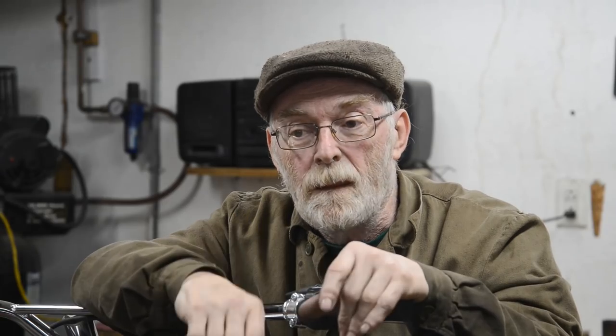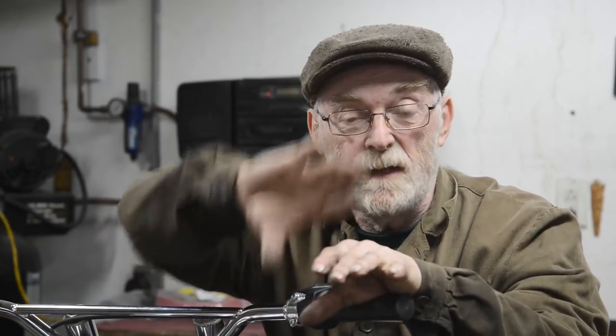So for our more pedantic viewers, perhaps you should go to Alan Milliard and see the most spectacular engineering work done with hand tools. Just as an example, one of the bikes he's built, he's built several of them, you know the sort of laid down Honda single cylinder four strokes, 90cc. He turns them into V-twins. He gets another cylinder and he machines everything in V-twins. He started doing videos where he actually shows the work, which he didn't used to do before. Today I was watching one where he made the single crank into a twin piston crank. And you think, okay, he's gonna lighten the flywheel webs, I wonder what he's gonna do that with. So he goes out in his garden, puts his foot on it to hold it down, and uses an angle grinder with a cutting disc and then a file. The man's genius, so that's Alan Milliard, watching.